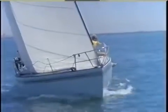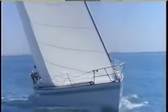Watch the top stripe as we crank up the halyard. Increasing luff tension moves the maximum draft forward and makes the sail slightly deeper. A smooth curve begins at the headstay and reaches its deepest point about 45% of the way aft. Also, you can see that the wrinkles are gone from the luff. This shape looks good for this moderate wind.